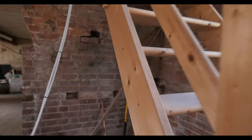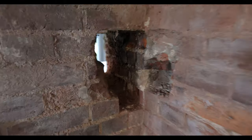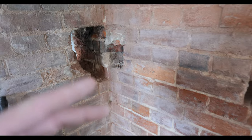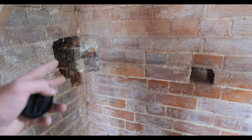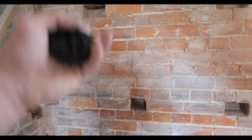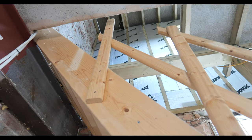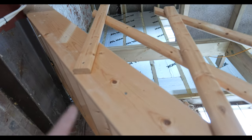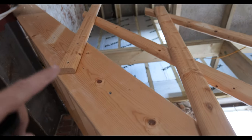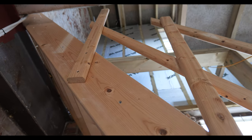The first part of our job is to get the main risers in. This is the other side of the boiler room - we've knocked through here and all this brickwork is actually going to remain exposed, so we need to bend our copper through nice and neatly, mount it on Munson rings, and then run it all the way up to the first floor joist level which is up there. These stairs are temporary - there's actually going to be a metal staircase fabricated in here. We'll run the risers all the way up to the first floor joist space and then start branching off to each location from there.